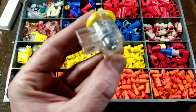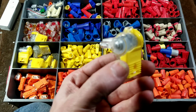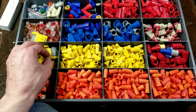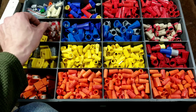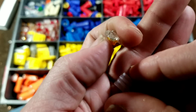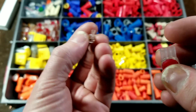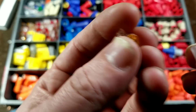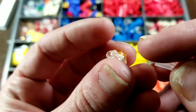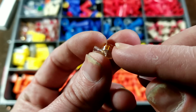If you need to make reliable connections in a hurry, there are connectors like these. This type costs two or three bucks for a single connector, so you really have to need it. These little guys are telecommunications cable splicing connectors, great for any small gauge wire. We'll sacrifice one of them. These would be for 22 to 24 gauge wire, for splicing that thin solid core wire, though appropriately sized stranded wire also tends to work.